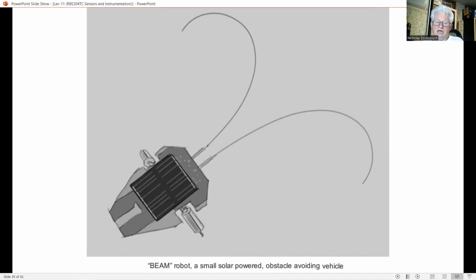Color information can be very useful in a number of applications, such as for painting robots, object sorting, for recycling purposes, and so on. A color camera is a suitable transducer, but when no spatial information, but just color is needed, a simple set of 3 diodes with color filters will do as well.